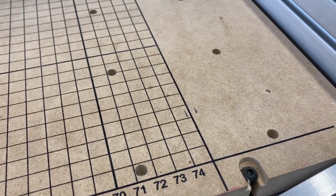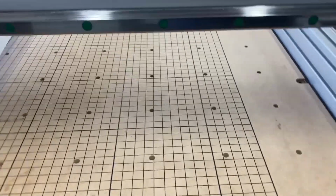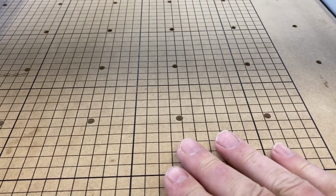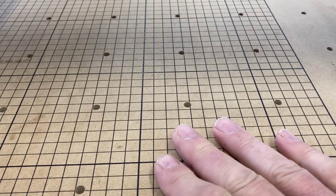But then what I did is I went into my Grbl settings in my Easel software, and I reset the X travel to its proper boundary now, which is 880 millimeters, and I reset the Y setting to 760 millimeters. And so I tested that, and when I tried to exceed it, I got an out of bounds warning, and my machine is totally safe. So the 760 millimeters of Y travel from front to back is roughly 29 plus inches. So I'm going to be making my new spoilboard significantly bigger than that, probably 32 inches, but here's what I'm going to do.